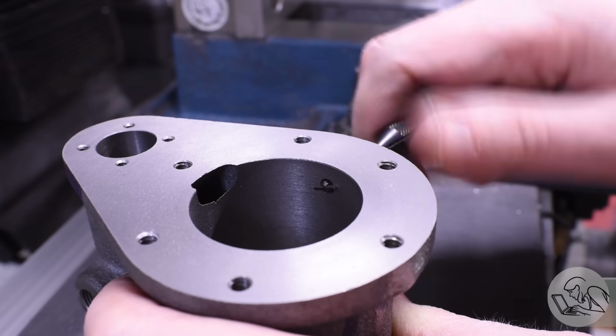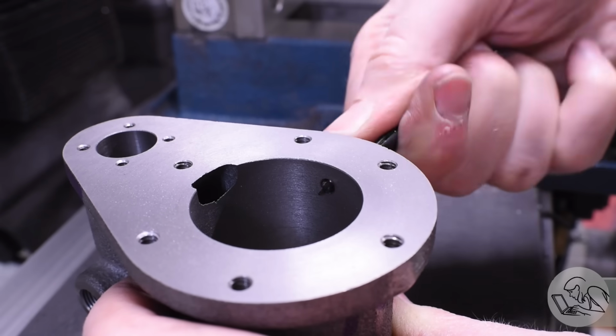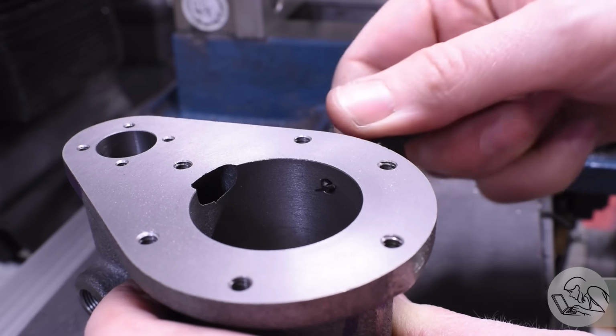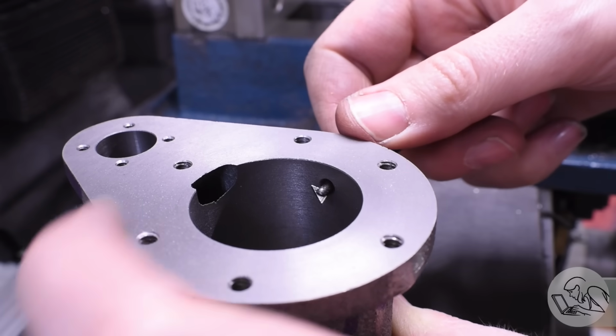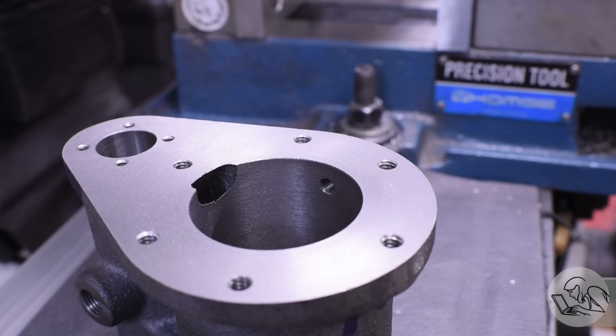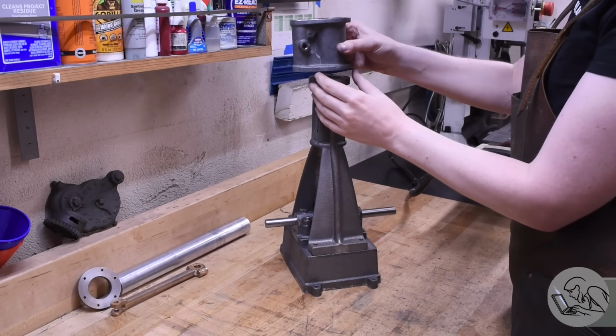You can see how it sits kind of in the middle of where the steam expansion area will be, so when the piston is pushing the old steam out of this end of it, if there's water in there, it's going to push it right out that hole instead of jamming up on the piston and hydrolocking it, which can potentially damage things. Smaller engines get by with just pushing the water past the rings, which works okay, it's just kind of messy.